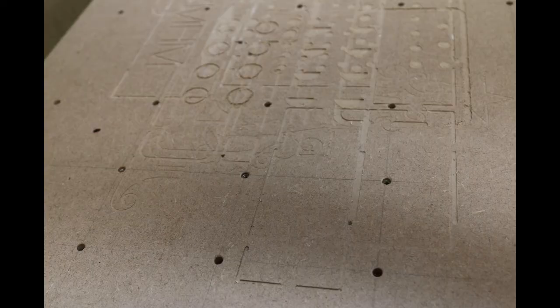Some would say all wood. My own solution is to have a grid of 5mm inserts fitted from the underneath, with the tops under the surface to allow cutting through material. These don't need to be accurately spaced — they're used individually.